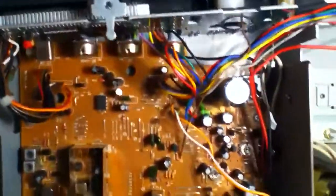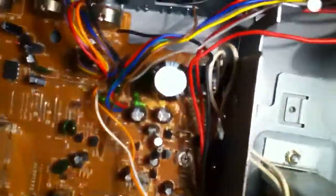To get this front panel off: first, pull all the knobs off — volume, squelch, RF gain, and channel. Then pop the side screws out, two on each side, and several screws on the bottom and top to remove the covers. You're going to want to cut the zip tie bundle on the wires. Before you pull anything out, there's a speaker mount — there's one screw way back in there that goes through the chassis into the front panel to hold the speaker in. I broke it; I didn't know it was there. So remember that screw — don't miss that one.